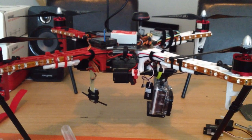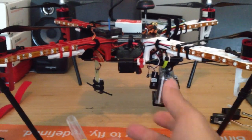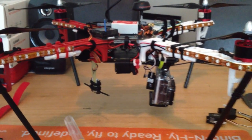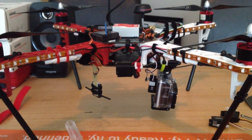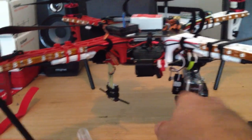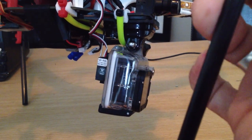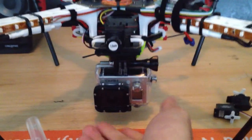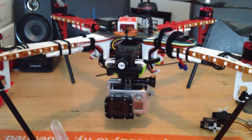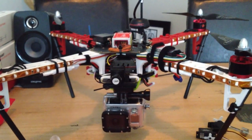This was great because I didn't have to buy a whole gimbal, which is more weight — I like to keep things as light as possible. The one I was looking at was the X468, a GoPro-carrying gimbal with pitch and roll stabilisation, which is £130. This is getting me close to the same results but lighter — it's just the servo. The only other thing you'll need to do is modify the hinge a little bit — I had to do some sanding to get it loose enough for the GoPro to swing, but still tight enough that there isn't too much lateral play, because you don't want it so loose it picks up vibration and gives you that horrible jello effect. Happy modding, and I'll speak to you soon.